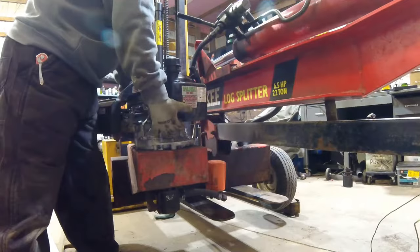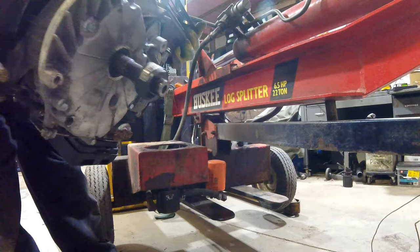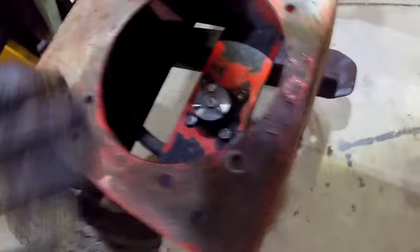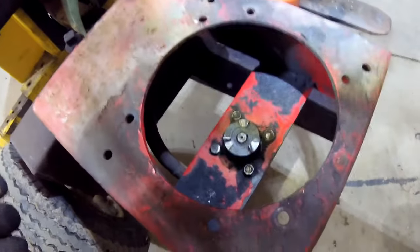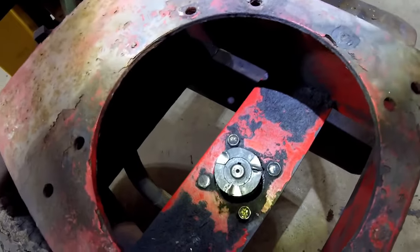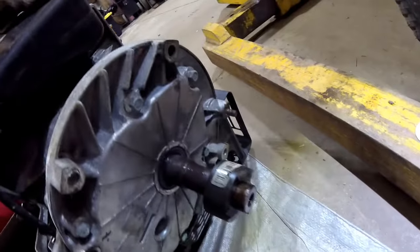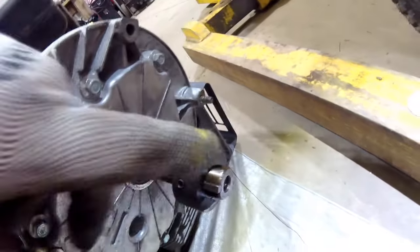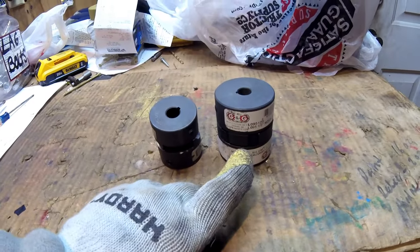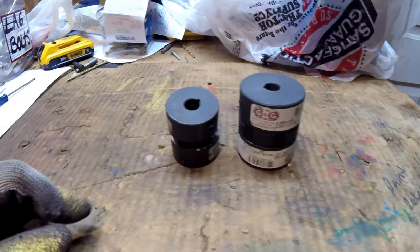Now I've got it down to where I can grab it, so I'm just going to lift the motor right off. You'll see I can get to the coupler very easily now. From the top I have a large hole to access the coupler — much easier than trying to reach in from the bottom over my head. Now I can access the set screws and replace the damaged coupler, and I'll do the same thing on the motor side. I'll remove this coupler off the motor shaft.